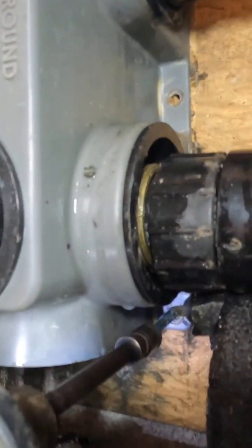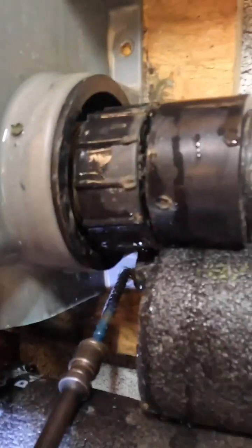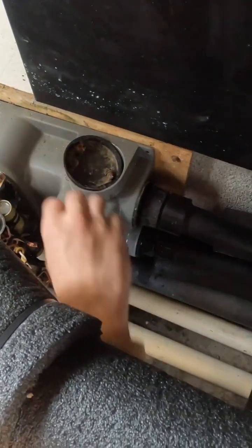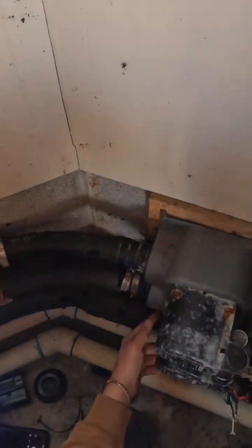See the whole flow center dropping down a little bit there — that's a good sign. That lets me know it's going to move when we get it; we don't want it to fall though. All right, got it loose here. I'm going to go ahead and drain the rest of the residual water out.